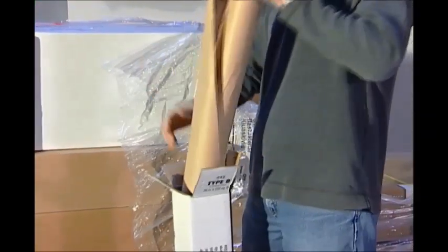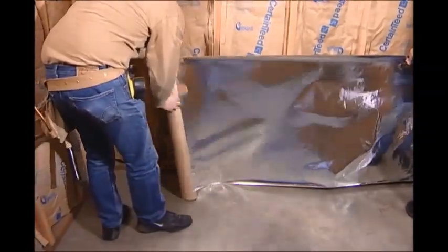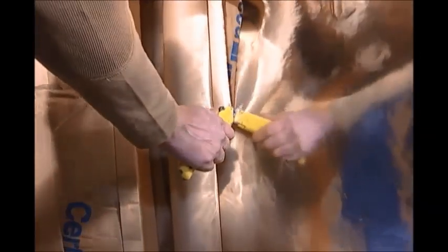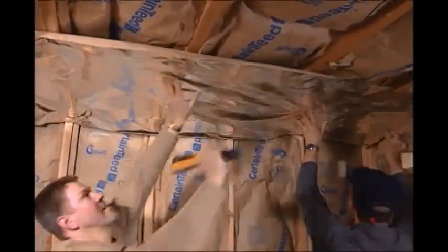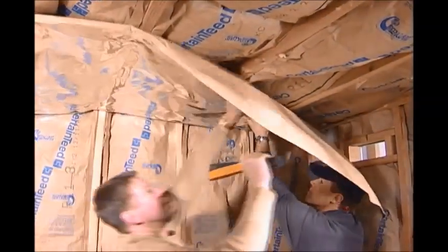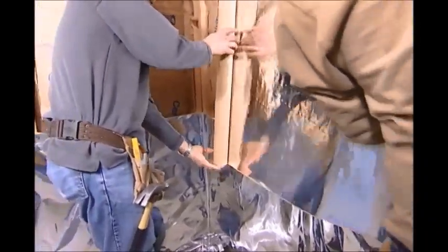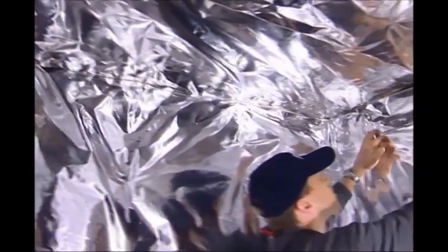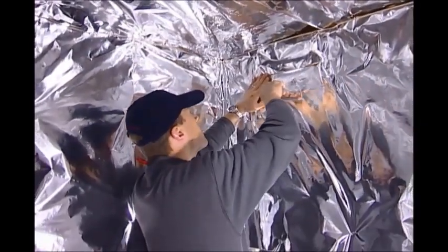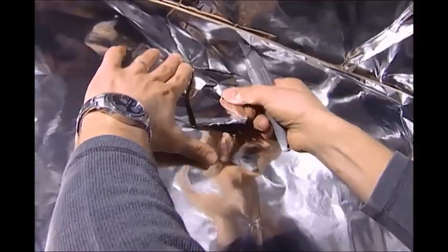Find the box that contains the foil vapor barrier. Apply this type C building foil to the ceiling first. Cut the foil pieces with a utility knife. With the foil side facing into the sauna room, use a hammer tacker to apply the foil in overlapping layers to the ceiling joists. Next, starting at the floor, apply the foil in overlapping layers to the wall studs. Once completed, the entire room should be lined with foil. It is not necessary to tape the seams in the foil. Cut holes in the foil with a utility knife for the vents and electrical.